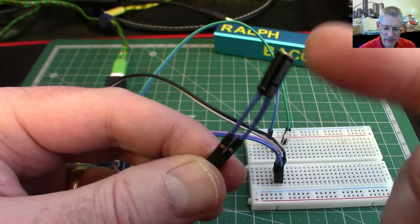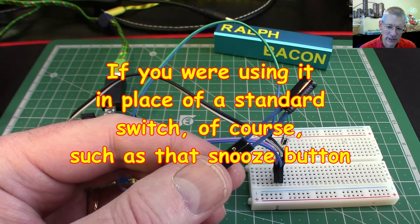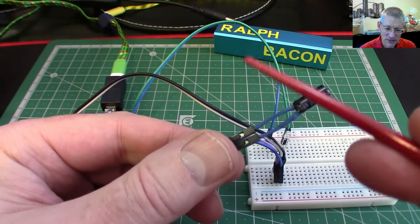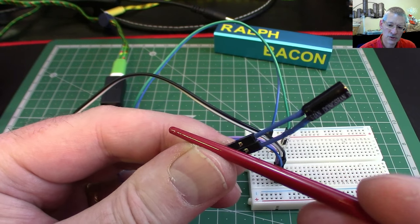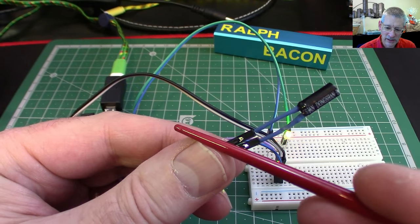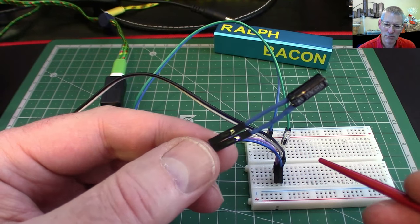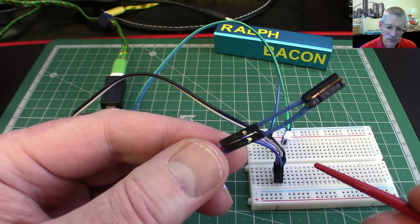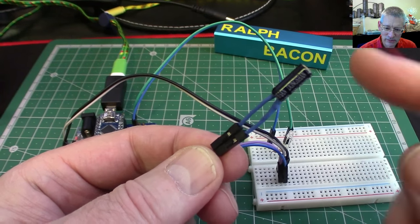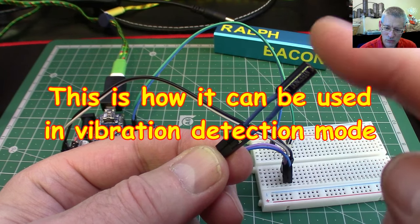This video is all about vibrations and detection of such things, so if you were to use one of these you'd probably have to be careful about switch bounce, in the same way as with a standard switch. When a switch makes contact, we humans tend to think it simply snaps down and makes contact — but in ultra slow motion any switch would bounce up and down several times before finally settling. Even if it only takes a few microseconds, that's more than slow enough for the Arduino to detect multiple pulses, and your logic could be totally flawed.